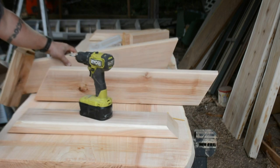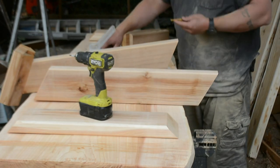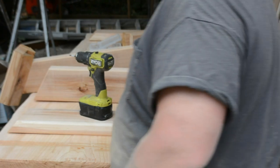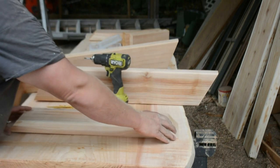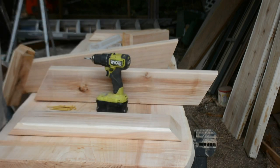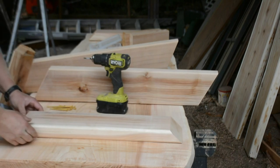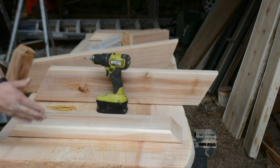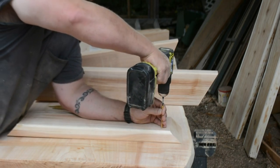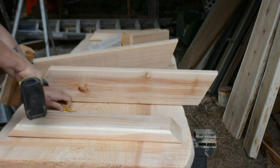I obviously have to do that on the other three legs, so I'll do that off camera. I shoot about three screws into those and eight here — this is what holds the leg assembly and the bottom half to the top, so you want this really solid. You want these out near the ends because the legs screw into the inside. If you get them too narrow, someone sits on the end and it tips up. I go about six inches in, and since nothing's straight, it's just an eyeball deal.